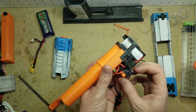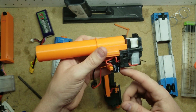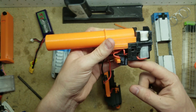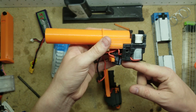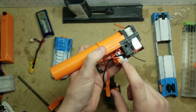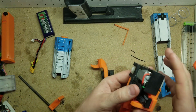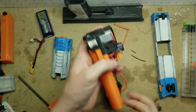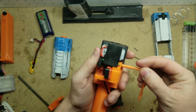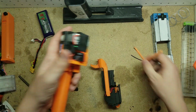It's nice and snappy. The same as before, the trigger presses the switch down, and as soon as you move the trigger, it unclicks and starts revving. The way that's done is you wire using the normally closed tab instead of normally open. The whole cage is just a big chunk, and the pin goes through here like that, and that's what holds everything together.